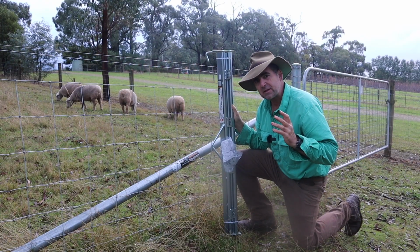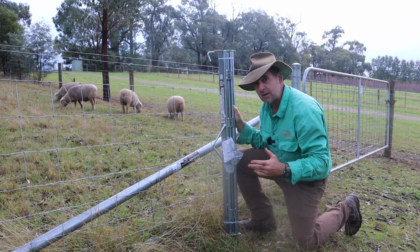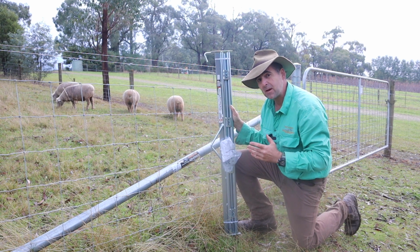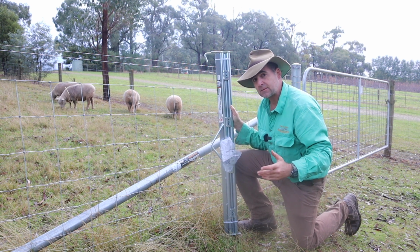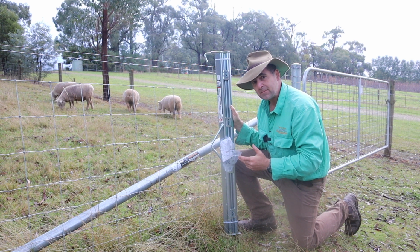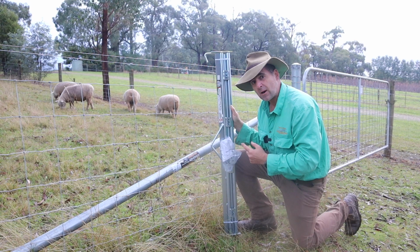And of course we mustn't forget, if you're going to be straining up prefabricated mesh like this sheet mesh, get yourself a set of decent strainer boards. I keep coming back to the wedge style design. I know there's a lot of other types of strainer boards on the market and some can get very expensive, but these are simple, the wedges are easy to replace, and they'll do you for years. Make sure you get a set that are at least 4 foot high or 1200.